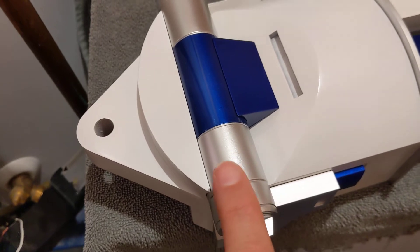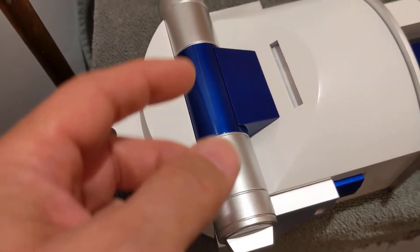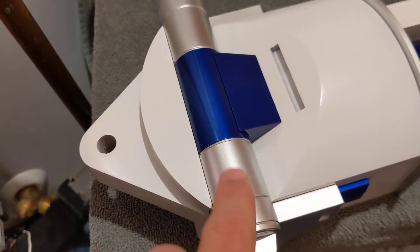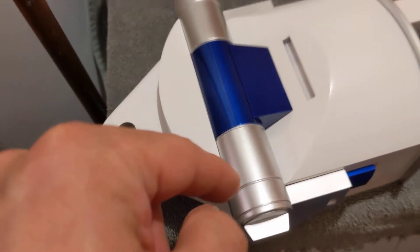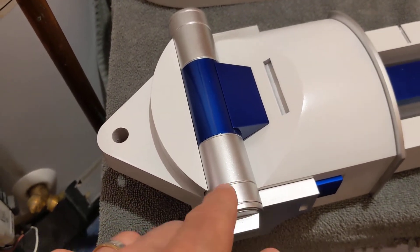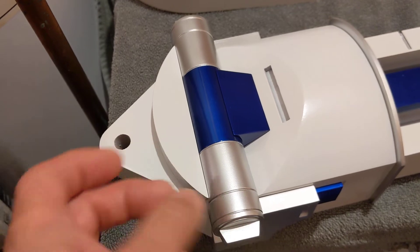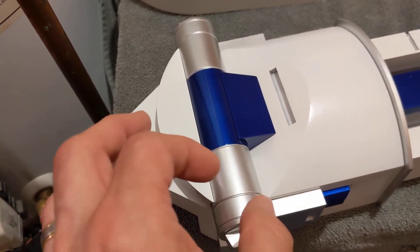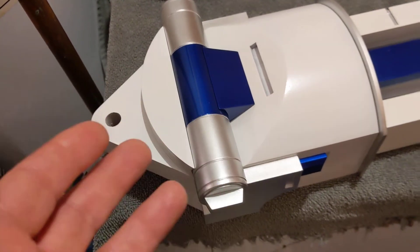But where I had the printer paper around the ends, the clear coat saturated that printer paper, which then stuck to the metallic silver paint. On one side of each ankle cylinder there was a very visible area where the paint wasn't completely removed — it was more like the clear soaked in and got into the silver, so it was still silver but discolored silver.